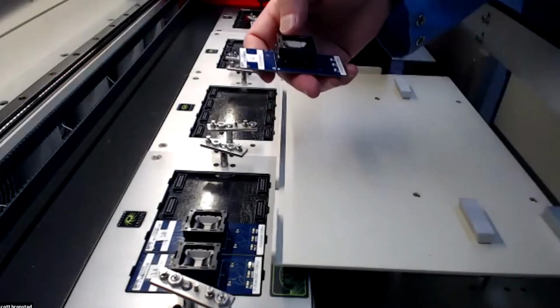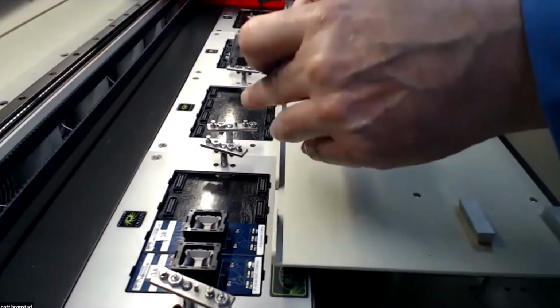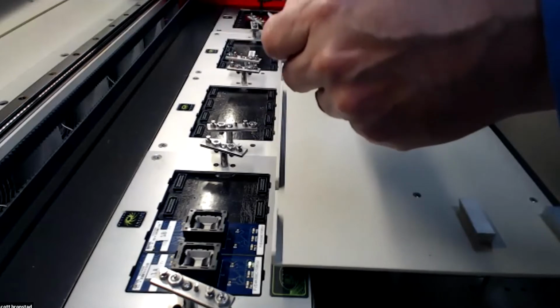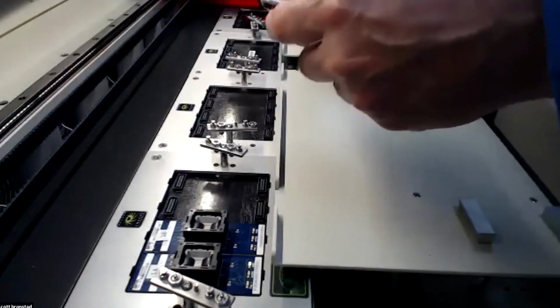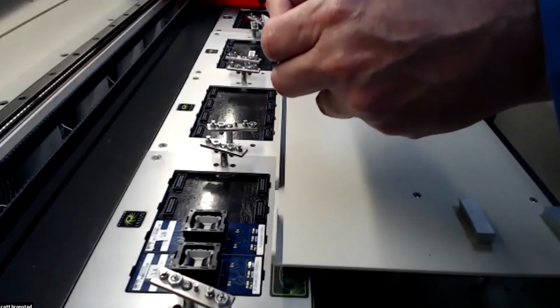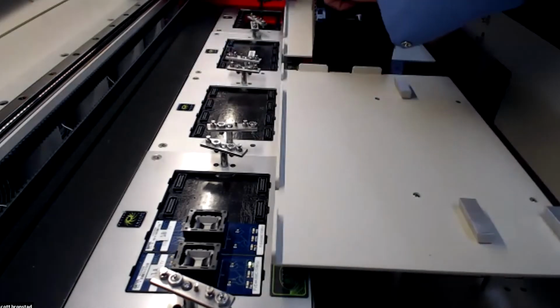The other thing is fault tolerance. By having individual socket boards, if one does go bad, unlike maybe a gang card where you have a trace, and if you're sharing circuits, you might have a problem where you have to replace the entire socket board. So there's a lot of positives, we believe, for that.